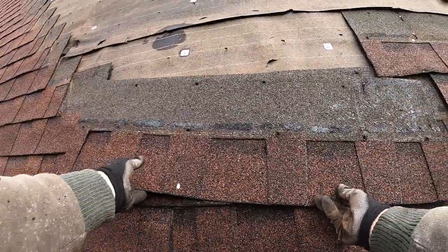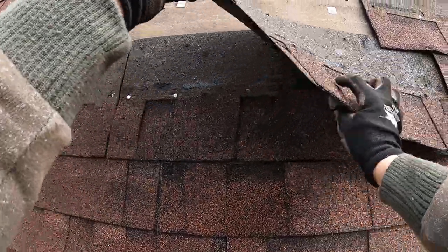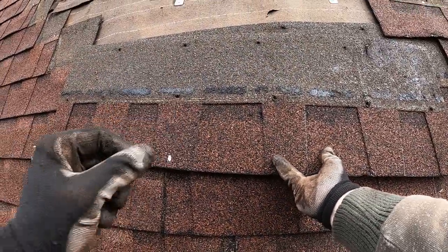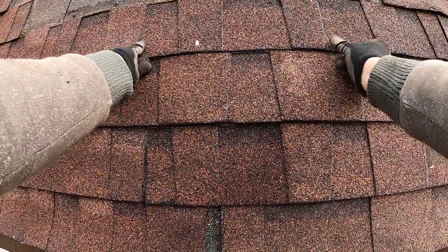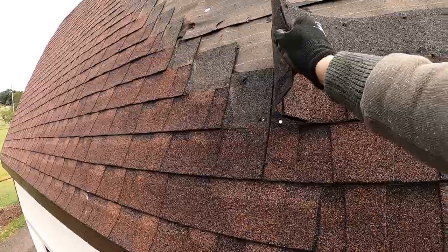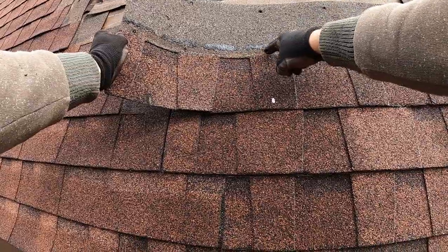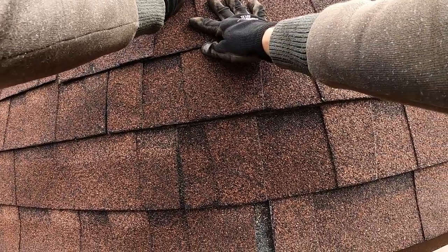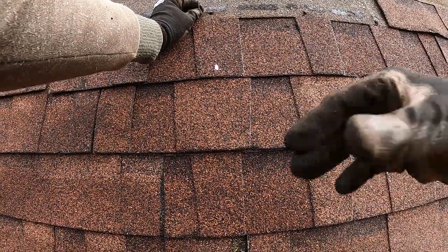The update time, as you can see, we got the shingles coming on very nicely. So, just to give you a little background on what I'm doing here, I'm taking care to remove all the previous nails, those little 1 inch ones, from the shingles that we're reusing that fell off. We're inserting them like so, and if you haven't done asphalt shingles before, we're nailing through the overlap here. And these are typically marked with a line that you can see right along here, and you can see where the existing nail holes went. You can kind of offset your new nails from those holes. You can drive them through too. You might get a little bit of a better hold if you just move them over a little bit.